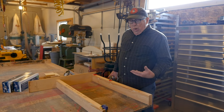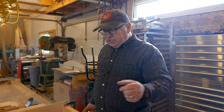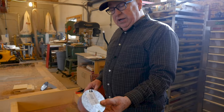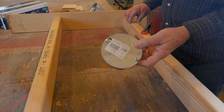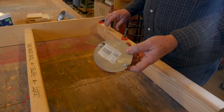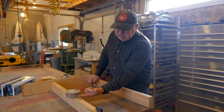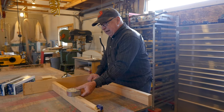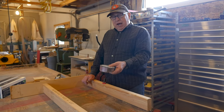When a place is being constructed — and we'll show you how to work with existing construction also — you're wanting to mount some kind of box that is rated for ceiling fan weight and vibration. How do you mount that? If you mount this on top of the rafter, it's going to stick way too far out of the ceiling where the sheetrock is. So there are different ways to accomplish that. The first way is to put blocking between these rafters.